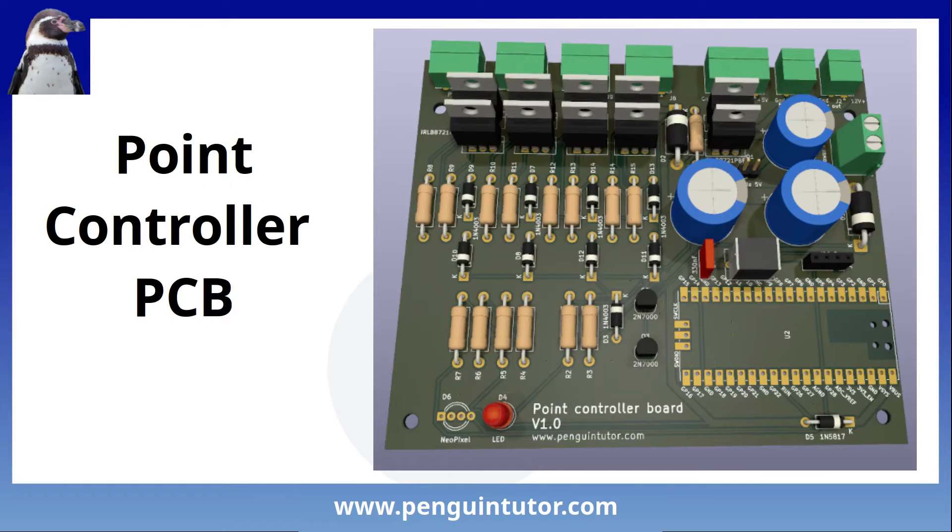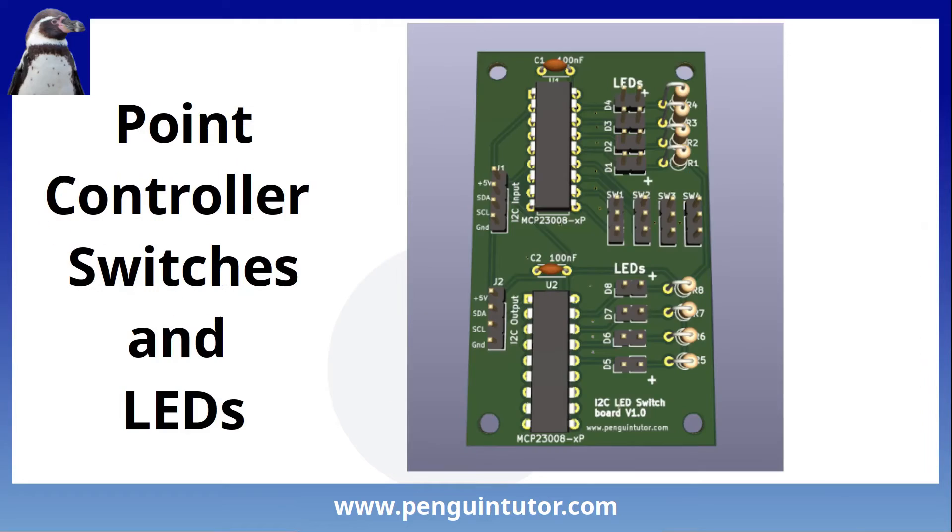The PCB was made and all components hand soldered. One thing that was a bit complicated is that the PCB footprint for the I2C MOSFETs were a bit too close together, making it really difficult to solder. If I made an updated version I would probably move these further apart. This is the second PCB - much of the board is shown as headers used to connect to the various LEDs and switches. In my build I've actually soldered directly to the board instead of using headers, as that gives a more reliable connection.